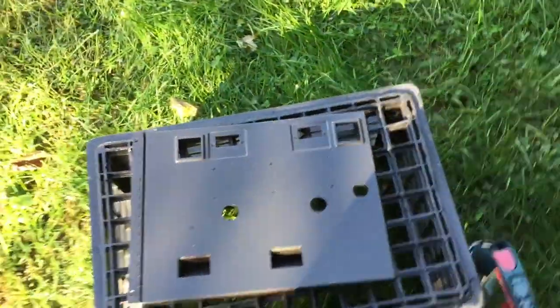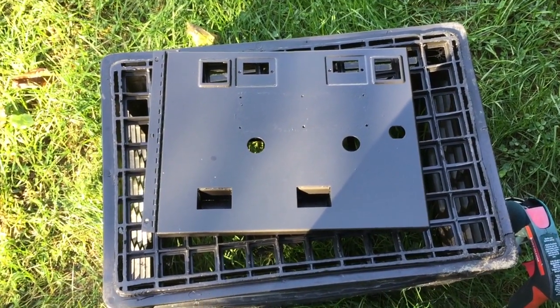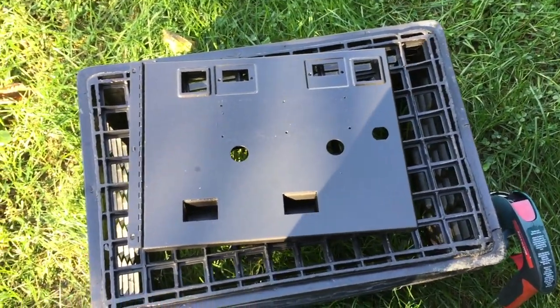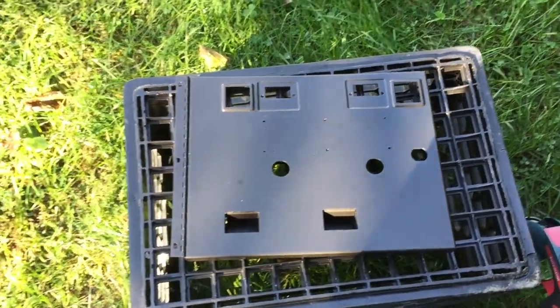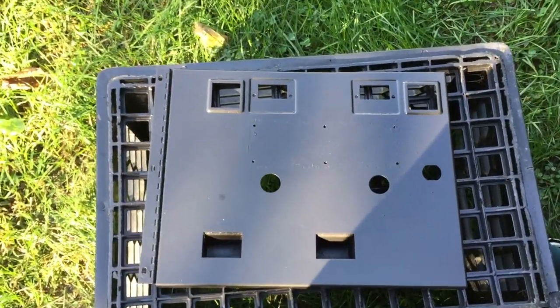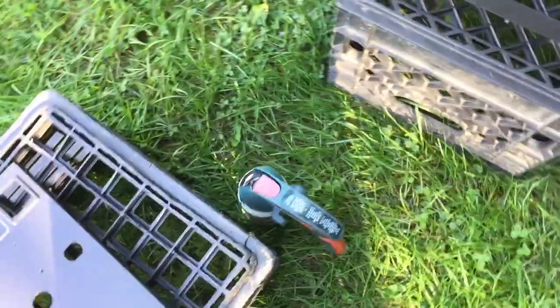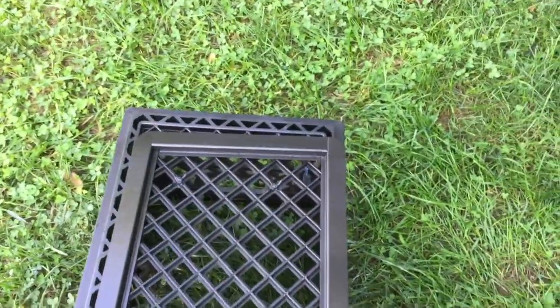For the coin door, I think I showed you in the video before how I used that appliance epoxy on it. I'm pretty happy with the appliance epoxy on the control panel, the marquee brackets, and the speaker. I wasn't real happy with the way it looked on the coin door because the coin door is less than perfect. The way it turned out for me anyway, any little imperfections you had really showed up. So I went with the tried and true hammered finish. So I went over the epoxy with hammered finish.